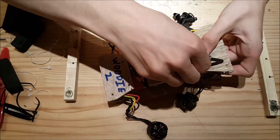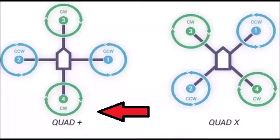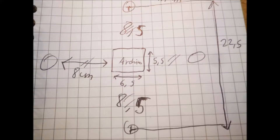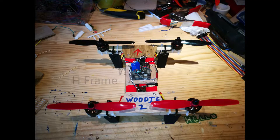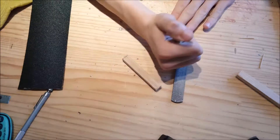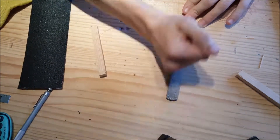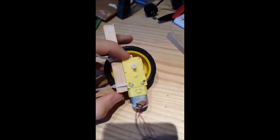I took out all of the bolts and nuts holding the old drone together. The quadcopter of this build will be a quad plus, as they're easy to build and weigh less than H-frame quads. So I made some plans with distances and started cutting and sanding the arms.